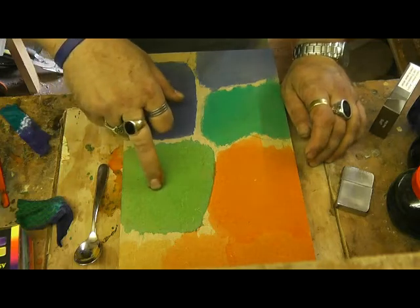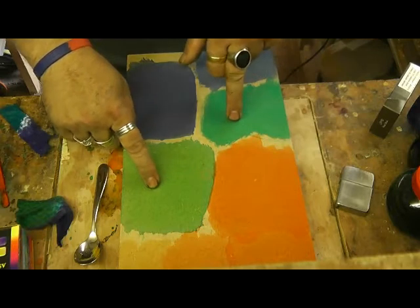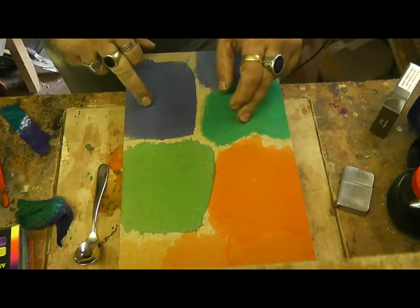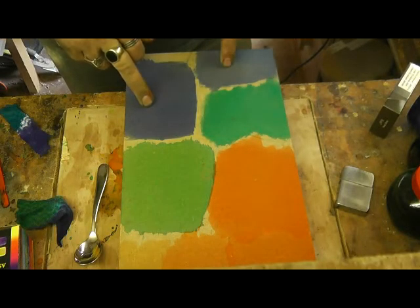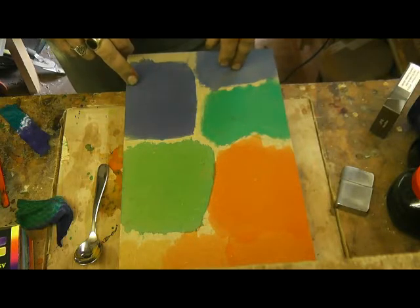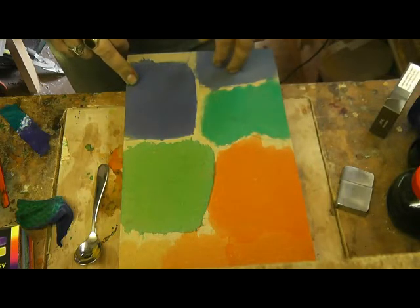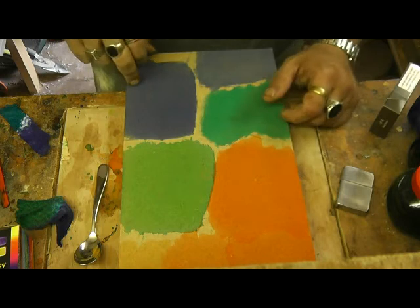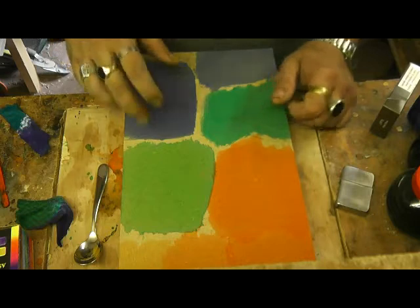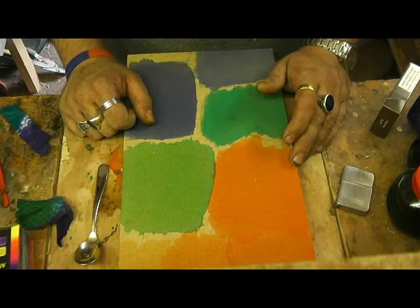For the greens — that's Emerald Green from Brusho, that's green from Crimson Guitar Stains that I got before Christmas, that's Ultramarine Blue, and that's Royal Blue from Crimson. The Crimson comes in a liquid concentrate bottle, or you can buy it pre-mixed. With the concentrates, one full bottle — which is 12 millilitres — mixes about right for 180 millilitres of water.